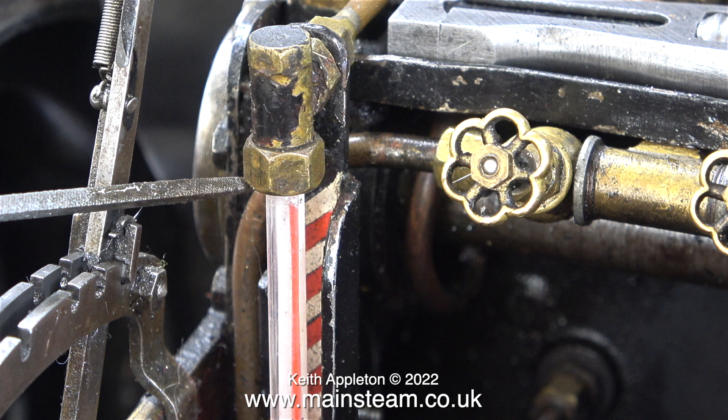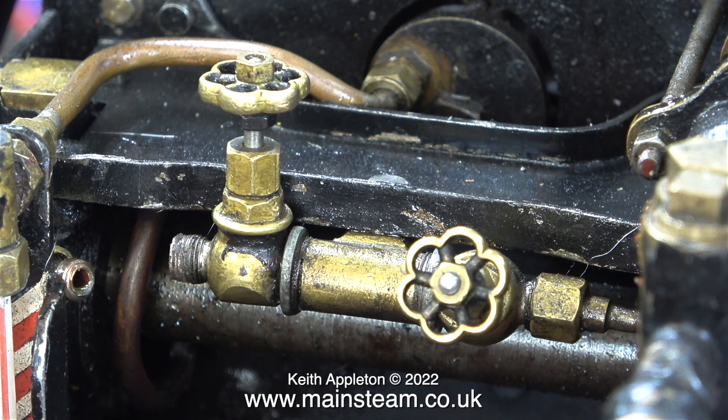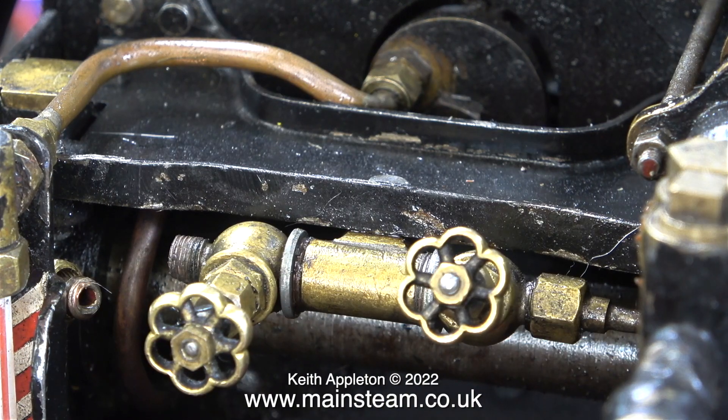If the glass isn't okay I will replace it. The customer also mentioned a leak in the area of this tap, and as you can see it wasn't fully tight in the fitting. With the help of some Loctite 542, I'm going to set the tap in this position — to remove this tap is quite a lot of work.